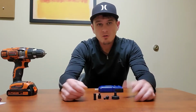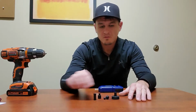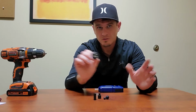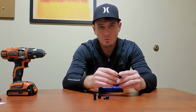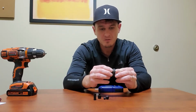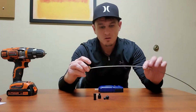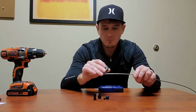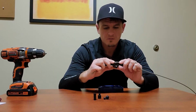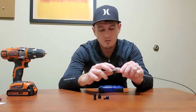The contact tachometer comes with a few different tips for measuring different types of rotating objects. It comes with a linear speed wheel for measuring linear speeds of things like conveyor belts or moving wire. It has a 1/8 inch slot built into it for measuring wire or rope speeds. So if you have a wire like this that's passing by and you want to know how fast it's going, you just set the wire there in that slot and take your reading.